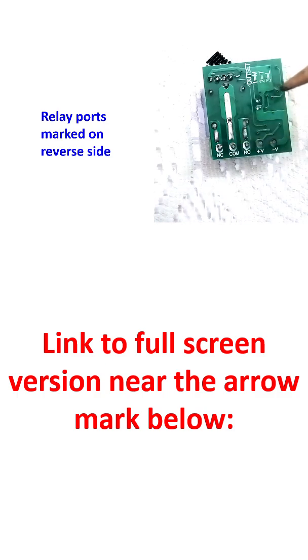You can switch it depending on your needs. My plan is to have a 40-meter antenna and a 6-meter antenna on the same coax. I don't know how much it will work out, but I will try. Since I want the 40-meter antenna to work always, I will have to connect it to the normally closed port.